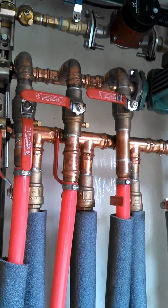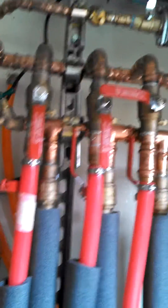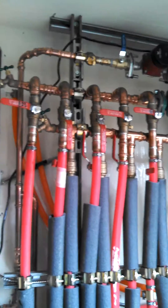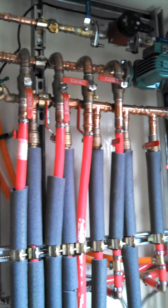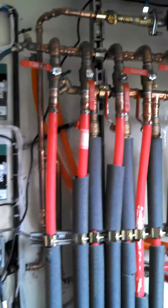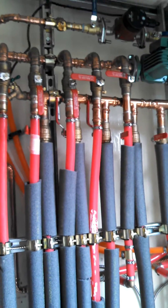My other two circuits are holding pressure as we're talking. What I usually do is I first pressurize the main supply and return, then I open up circuit by circuit to see which one I have a leak in. When I do have a leak, I go down each one and repair the leak or look for the leak before we proceed.